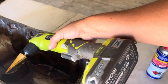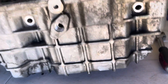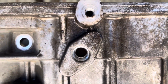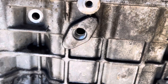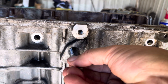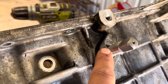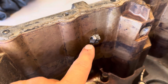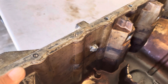I've got a bigger step bit on a 90-degree drill so it'll allow me to get inside there and get to that step. I'll put the phone down and just drill the back of that out and get rid of that little step. There it is - that took about two seconds. As you can see, bugger all swarf in there - tiny bit, but being aluminium it just drills out nice and easy. So I'll get that thread back in, work it all the way through. There we go - got the bottom of the tap bottomed out now. The back of the tap is where the start of the hole is - the tap is through on the inside.